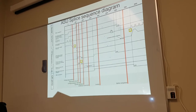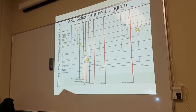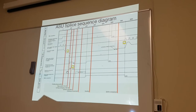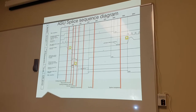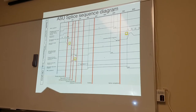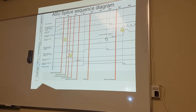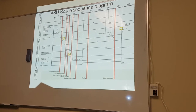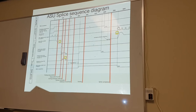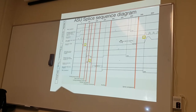Barcode. So from this position here to this position here, all the web is stopped. So during the stop time, finding stop position. Stop position found. Cut. Then retraction. Then we have retraction, sideways movement, then sealing. So everything still stops. Then packaging material unsticking. Slow speed. Then high speed. Then read the registration mark. Okay?